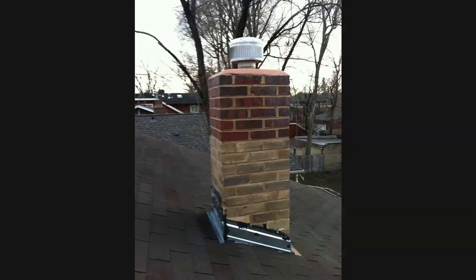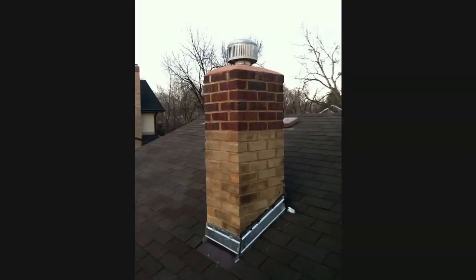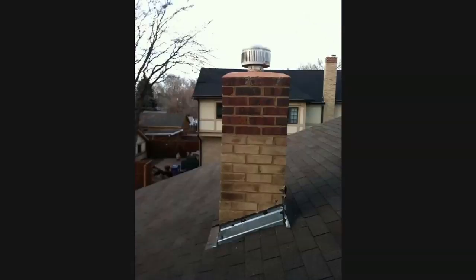Here's what we see as a final product. The mortar cap has lightened up a little bit in color. I've also washed the entire chimney down with a muriatic acid and water mixture to clean off the shingles. You can see there's no residue on the shingles, no mortar droppings left on the roof. We've done a good job of cleaning it — no residue left on the brick faces. We've got shots around the chimney from different angles, and it just comes out looking nice and clean with new mortar. This thing's good to go for years to come.